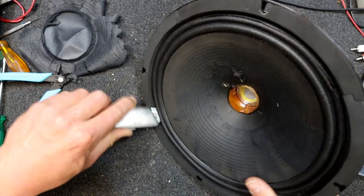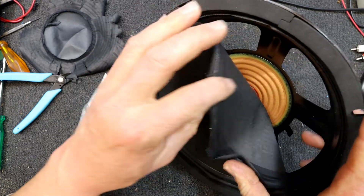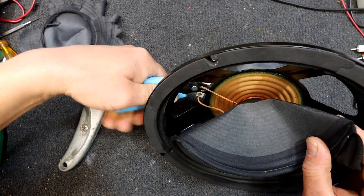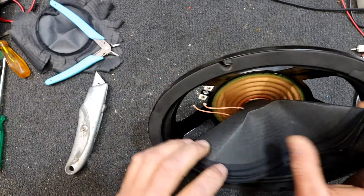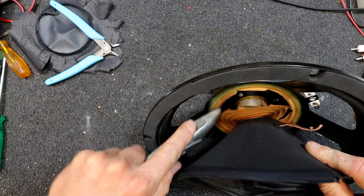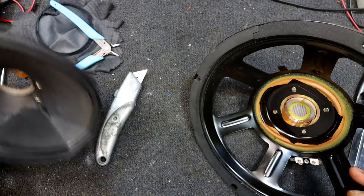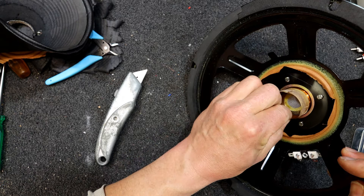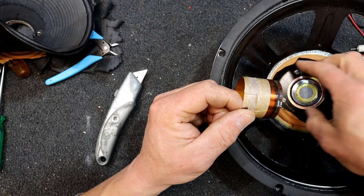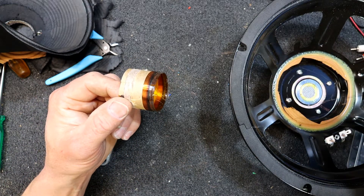I might as well slice this off. That's got the outer bit loose, now we've got this — we need to cut through this, and cut these wires and this yellow stuff as well. Because I've ripped it off, it's actually left the voice coil behind. There's the winding — it's right down in there. That does look a little cooked. That wire — oh yeah, it's cooked all right. This one didn't just go open circuit — there's quite a bit of wire still in there because it's basically been fried right off the plastic.